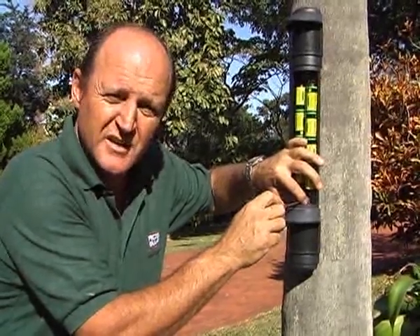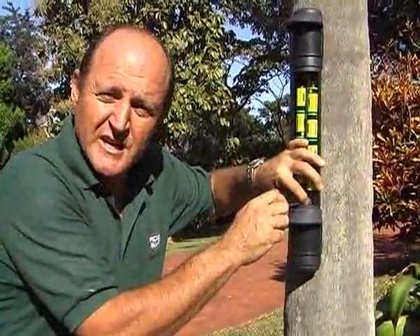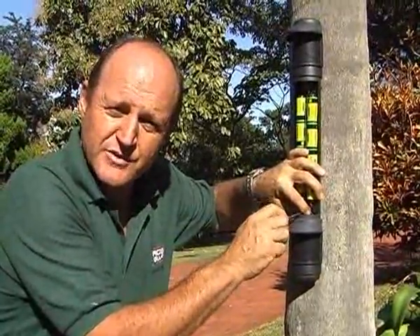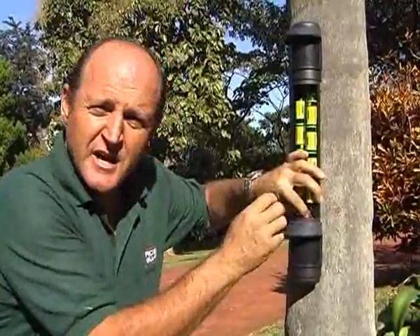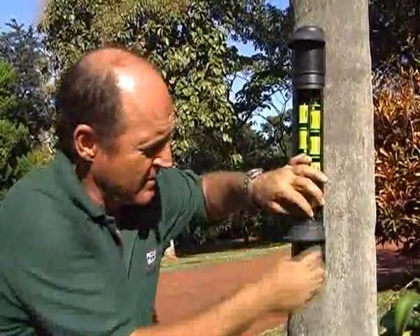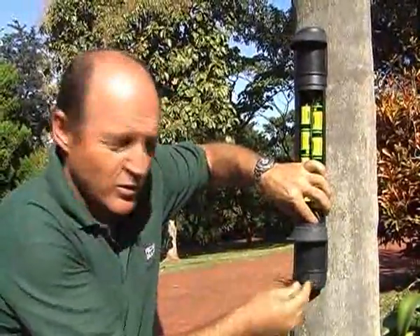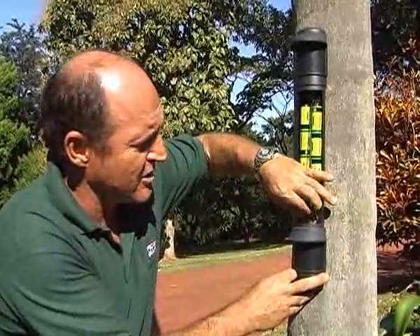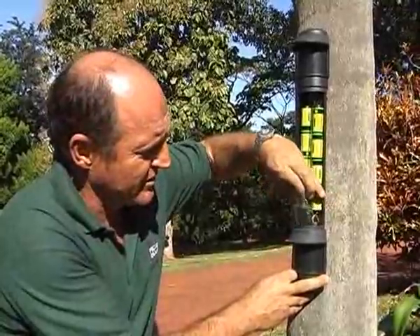In extreme circumstances, one would have to select one of RoboGuard's numerous false alarm algorithms. These are located inside the bottom sensor box. To get to it, one would have to remove the locking screw completely and lift the polycarb box right out of the RoboGuard.